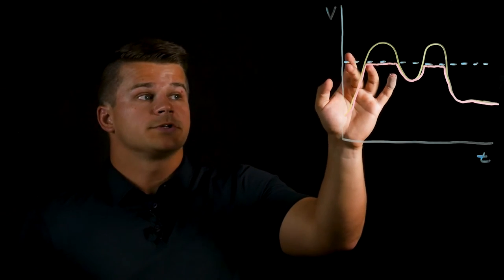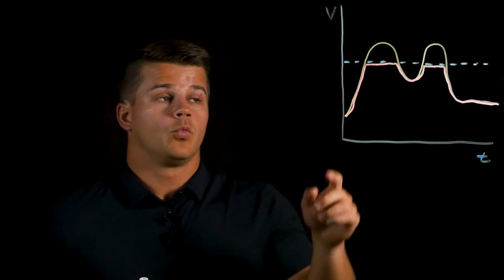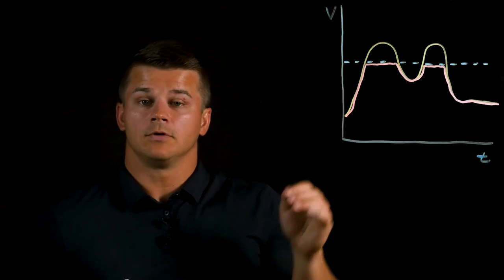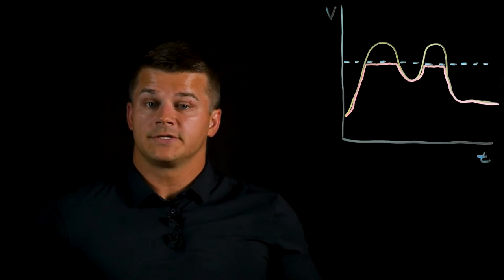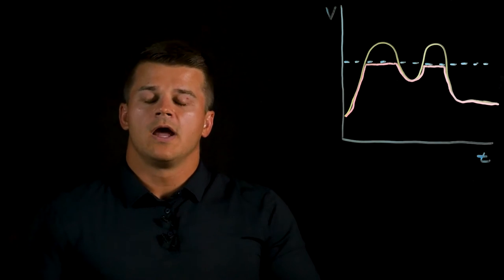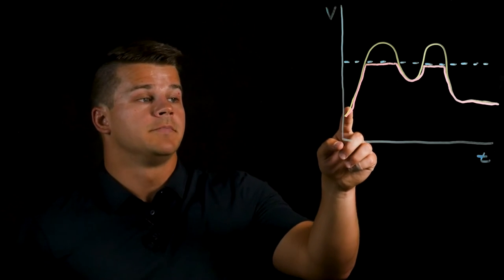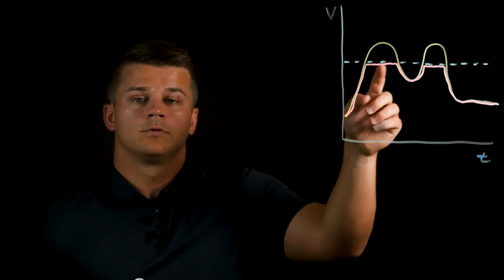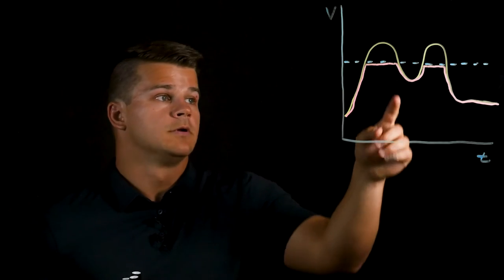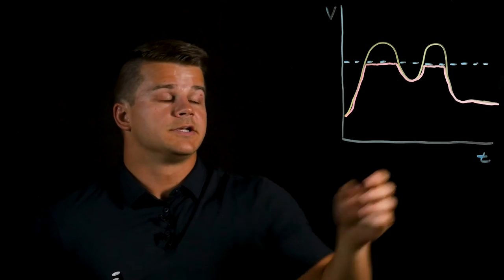With the addition of a braking resistor, you have the blue line here, which is its switch on/off level. Once the DC bus reaches this level, the braking resistor is engaged, any excess energy is dissipated across the resistor, and the DC bus value will plateau. This is shown with the pink line — the DC bus rises, it hits the blue line, it plateaus. When the braking resistor is being used, it drops back down, is used again, and continues on normally.